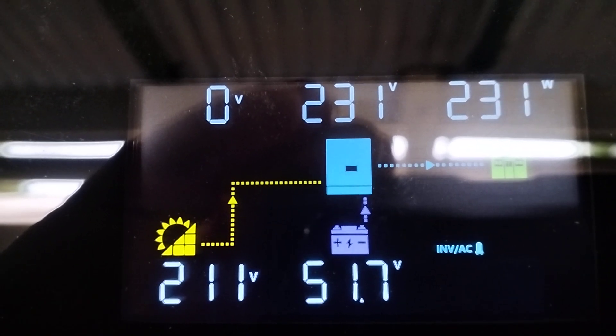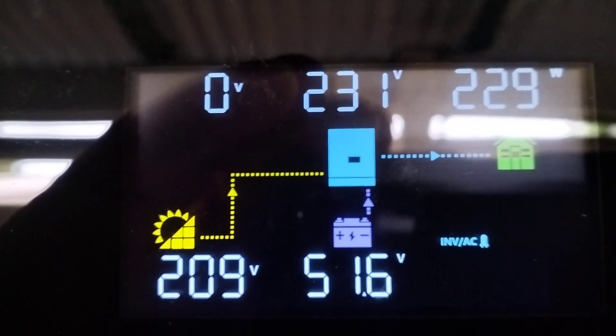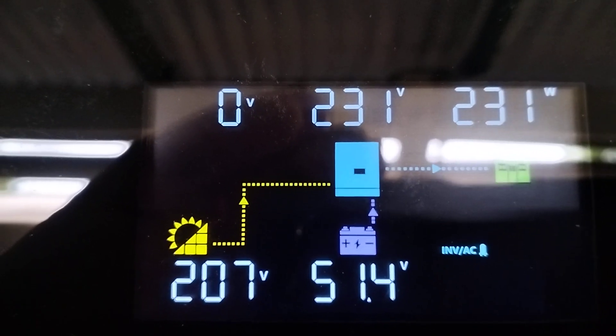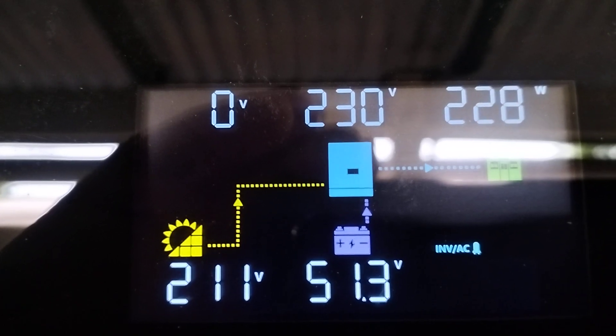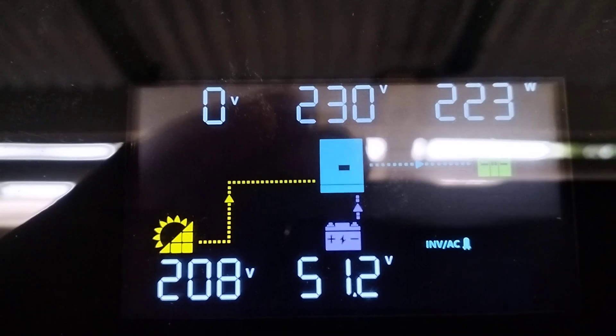We can see we're running 230 watts at 230 volts. That's a bit I like — that softer voltage, 230. A lot of our stuff's only rated for 230 and yet the grid pumps 245, 246 at times into us. So that's an appliance-saving factor in this inverter.